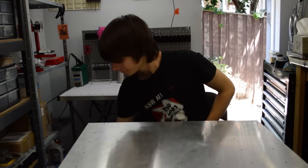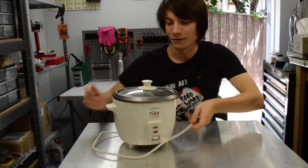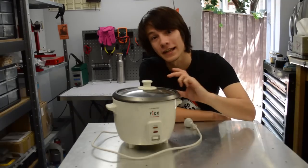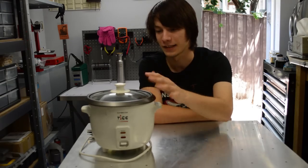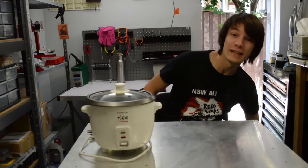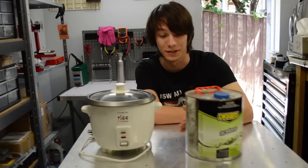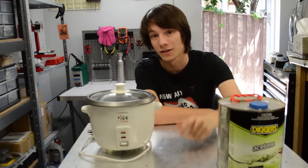You'll need a rice cooker. A rice cooker provides you with a non-flame heat source and an enclosed chamber to vaporize your acetone and get it to create a low fog which will cover your 3D printed parts. This one was just in our house — it was starting to flake the paint off into our rice so I claimed it for this. Secondly, you'll need acetone. Each time you use it, it's pretty much a one-way process — it'll vaporize off and you can't claim it back, but you only need a little bit each time.